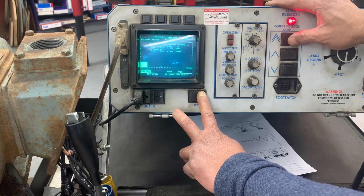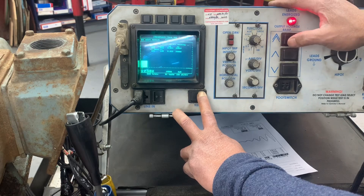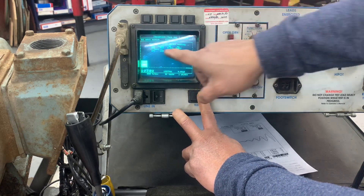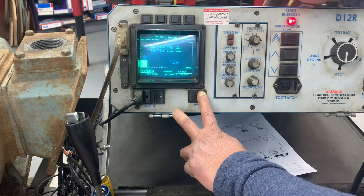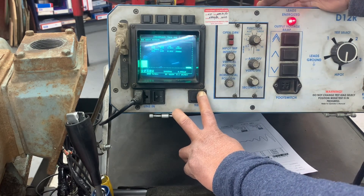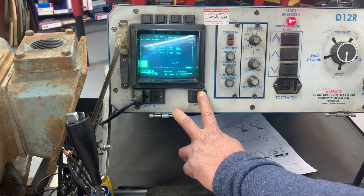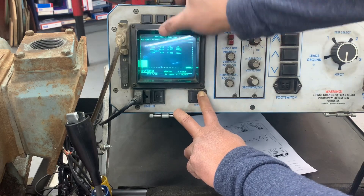Power up to 100, then power up to 1200 volts. Then go down to 10 — it will ask you to change to lower — then 0.1. Wait until 30 seconds again. Save hi-pot.